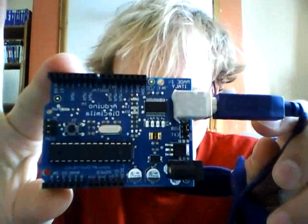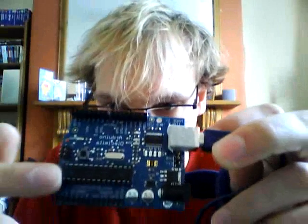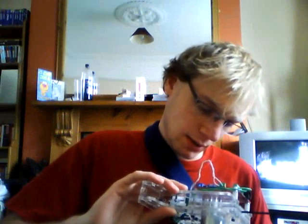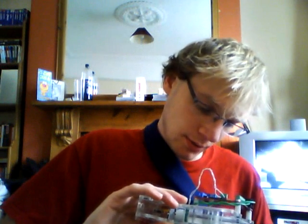The Arduino is actually the board and the whole thing. The program sits on this, which is an Atmel 168 or various other types. This is my Plastruder, and on there is a surface-mount Atmel chip — the Atmel 16820AU — which has been bootstrapped with the Arduino program. You can do that using a standard Atmel programmer; I bought mine from OOMLOUT, that's .co.uk, an English company.